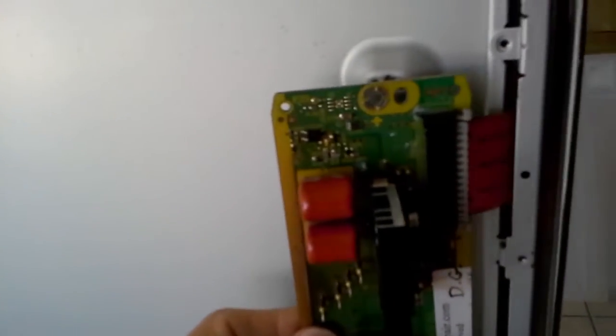You can see by the discoloration — which oftentimes scares many people — the discoloration of the board right up here. There's a lot of heat being generated, and that heat may or may not be directly killing the board. It's more likely the thermal cycles — the number of times it gets very hot and then cools off — that causes the damage. It's like bending a metal back and forth.